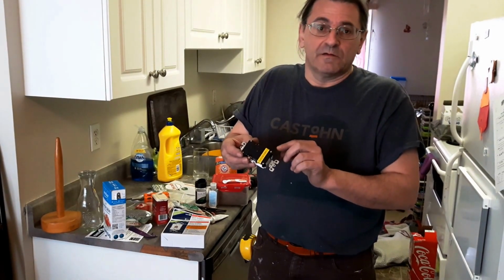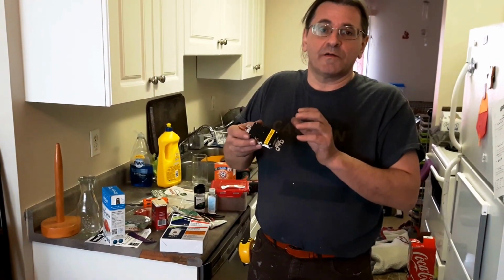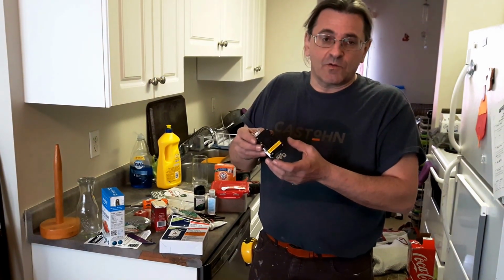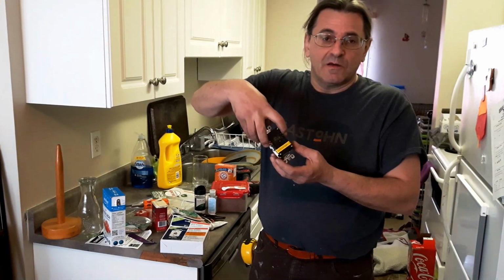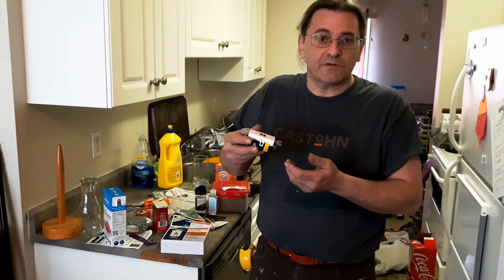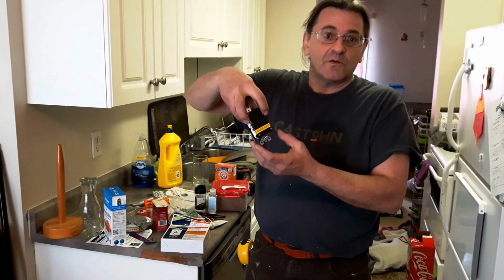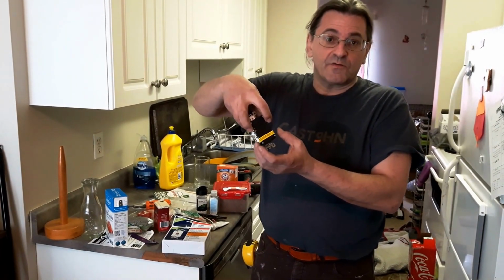Leave it there unless you know what you're doing and the reason why you are going to connect to those terminals. It covers up 2 terminals that are called load. These here are the power. So this outlet can actually protect, say, a whole bathroom by the power being connected to here, and then the bathroom fan or the light being connected to these other 2 terminals.